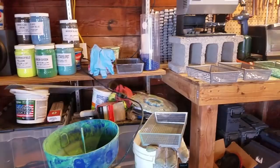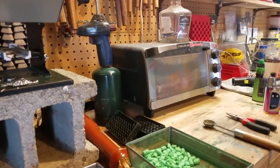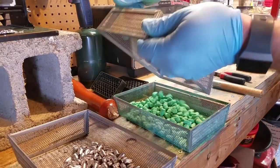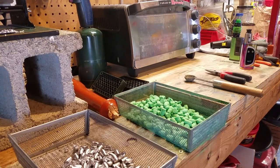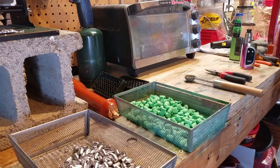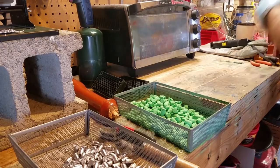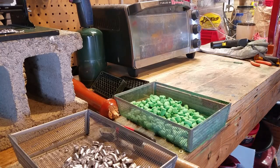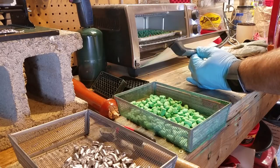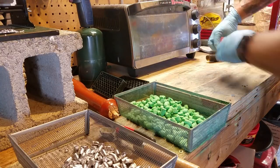Let me move the camera over in front of the table. Now I can just dump those in — it's not going to affect it. Powder coat paint stays on the bullet. Then I will put the rest of the paint back in. These are ready to go and stack up. I've got my thermometer — Harbor Freight, like 10 bucks. It's reading about 400 degrees. Those have been in the oven for the last 10 minutes at 400 degrees.